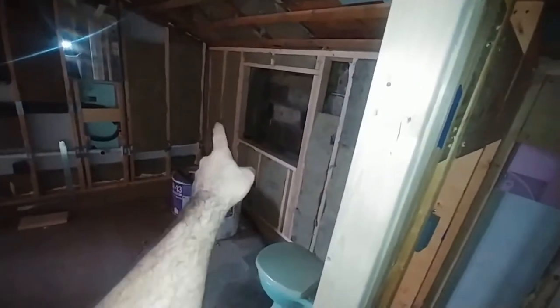But the window alcoves, I got some insulation. This is that rock wool, works so nice. That's basically solid rock wool, and this will be where they can slide that cupboard in. They'll have to route and pull a couple out to do some wiring there. There might be a little bit necessary, but the baffle goes in high enough that when he pours the loose insulation on top of this, he can keep from getting it in. Otherwise, he can add a couple pieces of that.